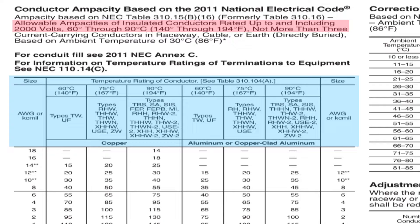The NEC does not differentiate between AC and DC current. There is no difference between AC and DC when we're dealing with 2,000 volts and less. For most residential solar panel setups, we're not going over 600 volts. Only a couple of places allow over 600 volts, and you won't be going over 2,000 volts. Up at that level — 2,000 volts — those are commercial grade circuits and they can be quite dangerous.